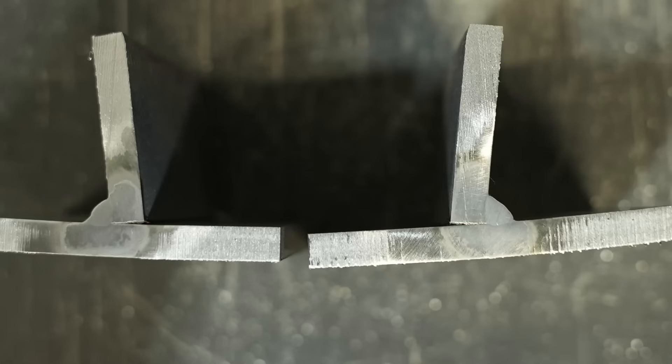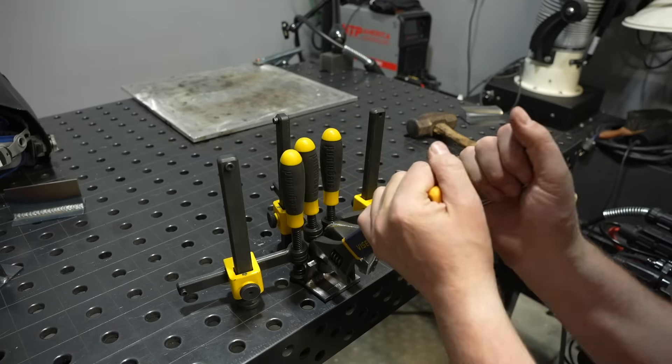Since I cut it anyway, I figured I might as well throw a light etch on there, and you can see some penetration into either plate. That looks fine - it barely got down to the corner at least at this section - but breaking it in half will show a little bit better representation of what we have along the length. Let's see if I can get these things in half.